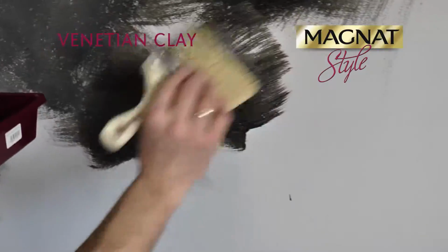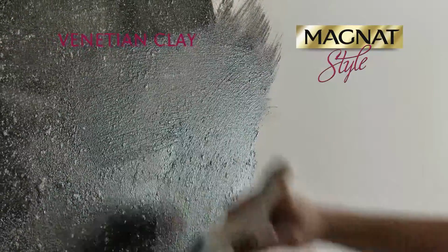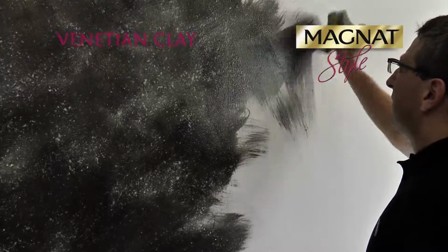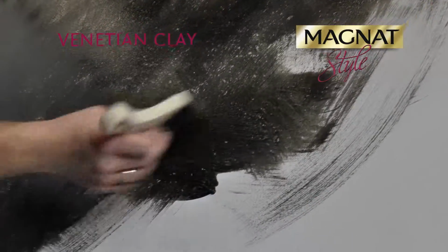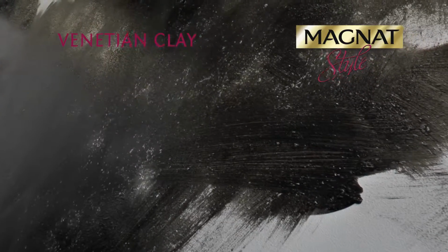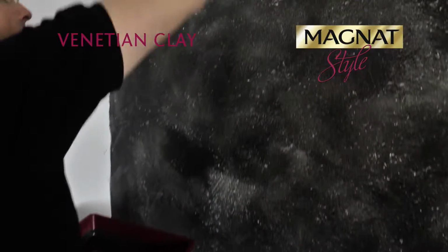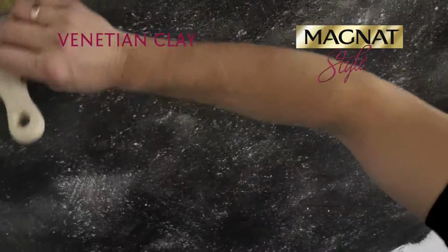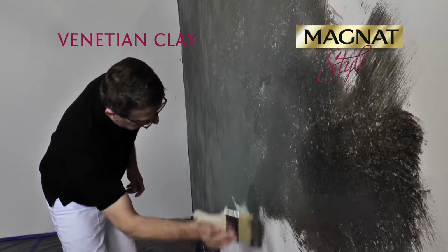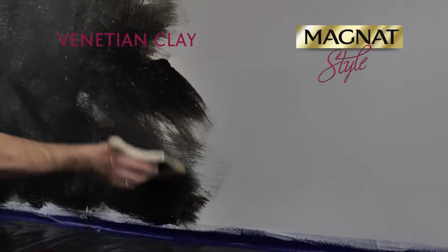The Venetian clay is recommended to be applied in 1 thick layer. Do the spreading gently so as not to crush the white particles. Each time you have coated about 1 square meter, spread the paint with the semi-dry brush to level out possible streaks or smudges and obtain a shaded texture. When coating larger surfaces, remember to frequently stir the product in the container.